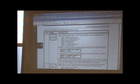And also, to go from page to page, you use the page keys. To go from line to line, you use the line keys. So using that and looking over here on page 3-1, you can see what it's talking about. You have your actual values, you have your set points, you have help, reset, clear, and store.